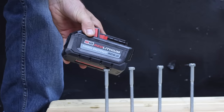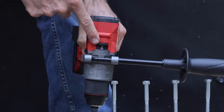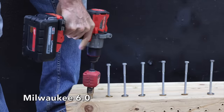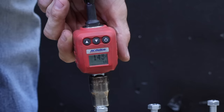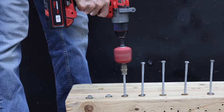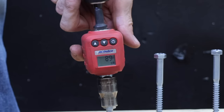A battery-powered tool is only as good as the battery. Using a Milwaukee drill, let's test maximum torque in second gear, beginning with the 6 amp hour Milwaukee. The Milwaukee made quick work of the 5-inch lag bolts and reached 183 inch-pounds. The LabTech gave up 40 inch-pounds sooner at 143 inch-pounds. The Amityke couldn't feed the drill enough juice and gave up very early at only 89 inch-pounds.